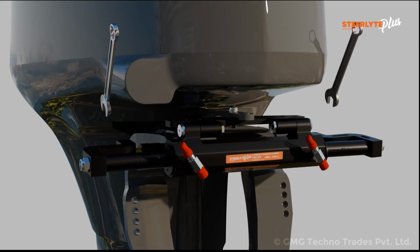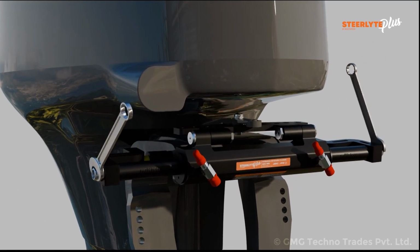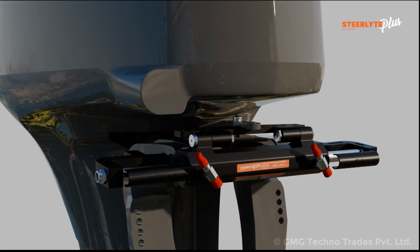Tighten first the center shaft nuts and then the piston rod nut by using a 19 mm wrench with a torque of 70 Nm. Adjust the space on the tilt tube by tightening the mounting spacers until the clearance is eliminated. Remove the center alignment tubes from the piston rod.